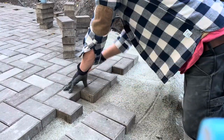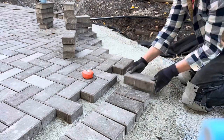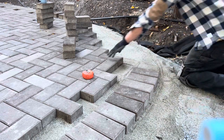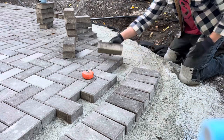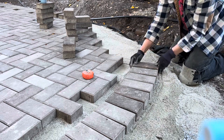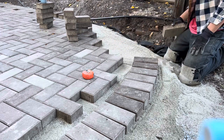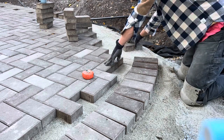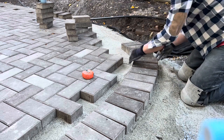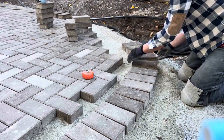I'm doing a pretty free-formed curve here. I wanted to show you not just one radius, but a compound curve where it's going to have a couple of sections — a little bit tighter, a little bit looser, curving in and out just a touch. The reason I wanted to do this curvature on the edge is that it's going to work out nicely for the river rock detail up against it. The end curve is actually going to capture the tree above it as well, so it kind of frames that. Starting from the soldier's course closest to the camera, I basically used the gap on the outside edge as a reference to keep the curve nice and consistent.